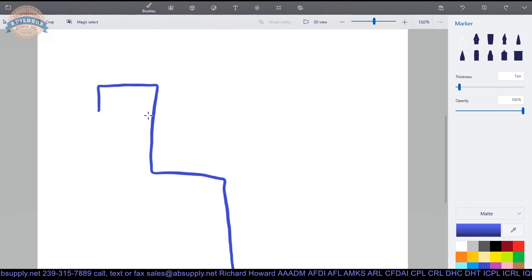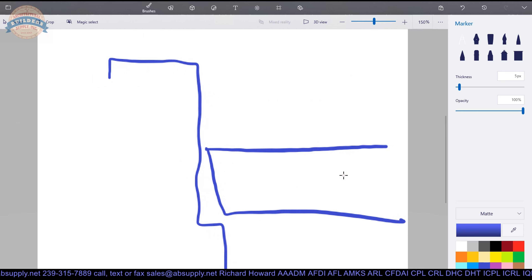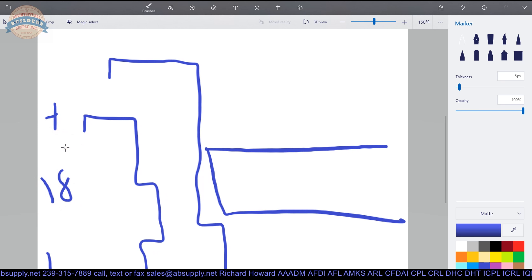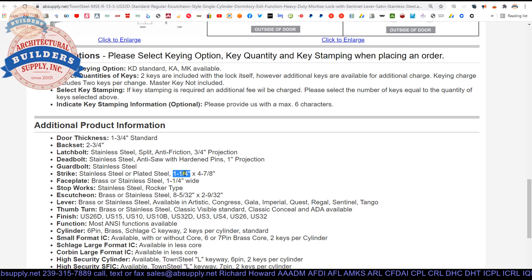You could also have a wood frame with an incredibly deep inset — a frame where that dimension happens to be 18 inches. It could happen. It's not common, but I've seen it. In that case you need a long lip on the strike. That's what we're talking about when that dimension is declared — it's the centerline of the hole to the edge of the lip.